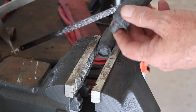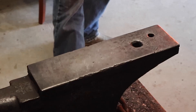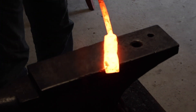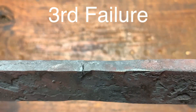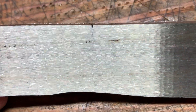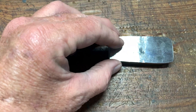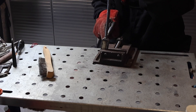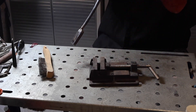Cut the can off. Again, everything went pretty smoothly. I did see a hairline crack in there and I tried to grind that out — that's where you see a little bit of an indentation on that billet there. But I didn't get it all out, so I could see another crack. After grinding the surface you can see it even better. So what I decided to do was just cut it in half with the saw right where it was cracked, and then take the two ends of the billet and try to forge weld those together so I could still salvage the material and get a knife out of it.